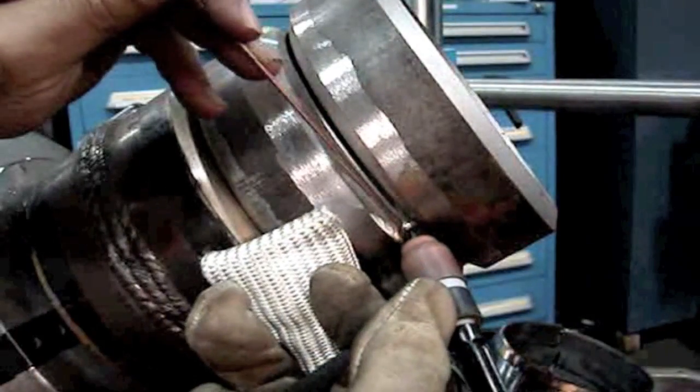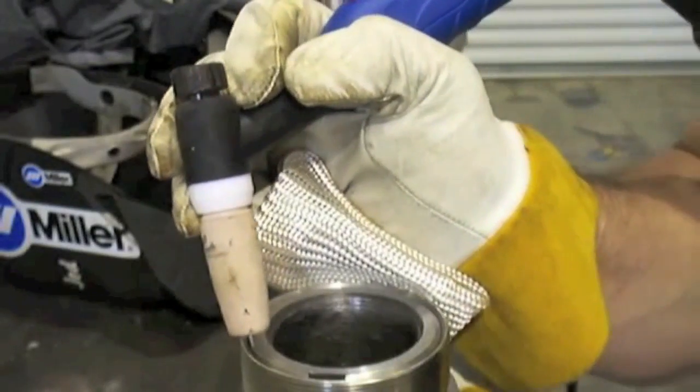I'm welding a little cover plate on a piece of square tubing. Sometimes you have to go to great lengths to find a place to prop, but you don't if you've got a TIG finger — you can prop right against the metal right near the weld. For a 6G pipe joint, once again, this same root technique, open butt root, laying that wire in there works really well.